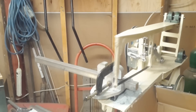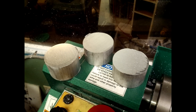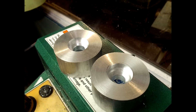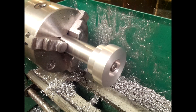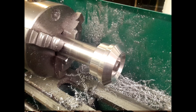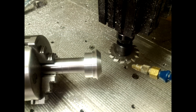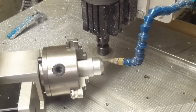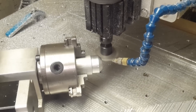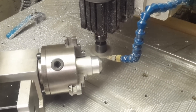This is my power hacksaw that I also built, and this cuts all of my blanks for me. These are the three rough-cut pucks, the blanks. Here they are faced and turned with the bearings, the pockets of the bearings. They're installed on an arbor in the lathe and turned to the various dimensions that they need to be. Here the bevel is applied, and there they are — there's kind of a before and after right there. And then they move on to the CNC. This is in the fourth axis, the rotary axis. Currently the machine is moving from X to Y with what's called an involute cutter — it's a gear cutter, and it cuts not so much teeth of gears, but spaces in between teeth. It's a very specific shape, and it'll make a few passes for depth.